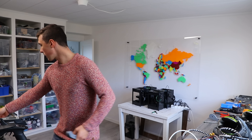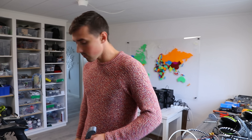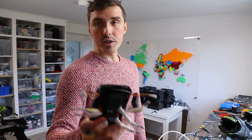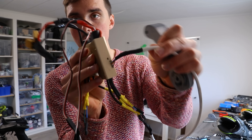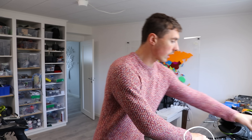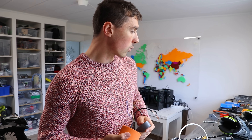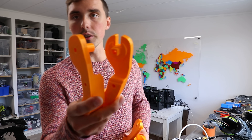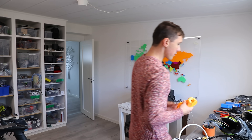What's going on is un problemo — it's actually 10 different problems. It boils down to the controller and the 3D print: it's supposed to be a little square that fits into the motor, and that sheared off, which caused the motor to short circuit. That also ruined the controller. So I salvaged my other controller from another skateboard — that didn't work. I went through a third and fourth board. I found speed controllers with the correct pinout on the sensor cable and a replacement motor. I printed new mounts, a little stronger, adjusted a few parameters. Had a mental breakdown, lost hair, but now it's fixed.